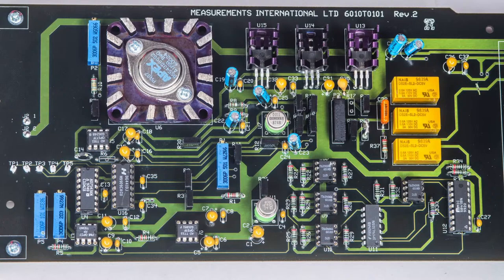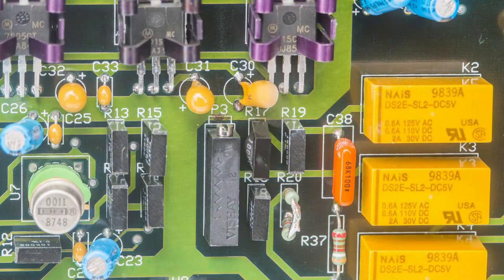And this board is made around, let's see the date codes, 1999, but actually one opamp in the center, it's from 1987, it's BB branded opamp, OPA445BM. So this is the closer up on the same photo. That opamp U7 I was talking about on the left side, next to 10 kilo ohm and a bunch of 10 ohm resistors.